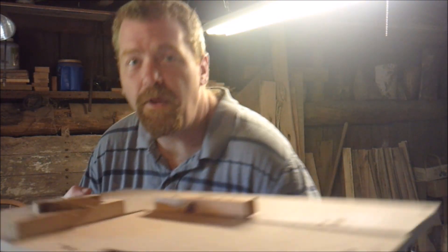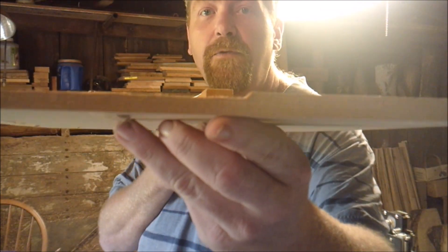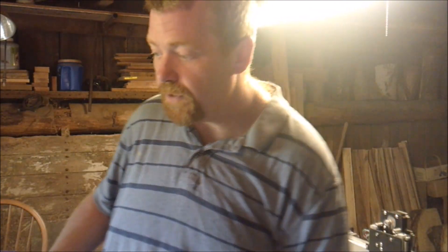I've been having to flatten the bed of my machine. You can see where I've had to flatten it several times — it was getting thin. My CNC machine is out here in the barn. It's damp and humid. MDF absorbs moisture, it warps and bubbles it a little bit. Just a hair, but a hair on a machine running on thousandths of a millimeter is a lot, especially when I'm doing 3D carving — it makes a big difference.